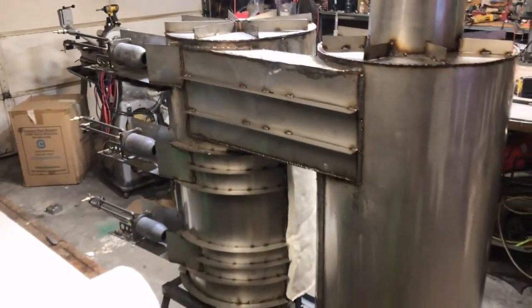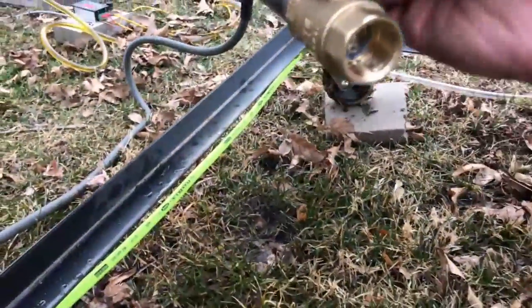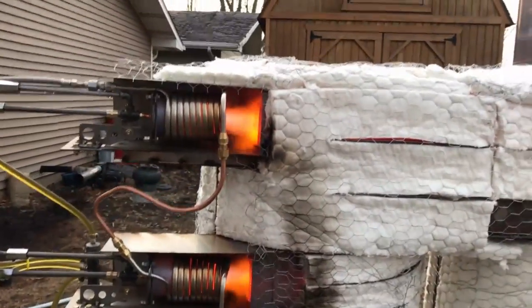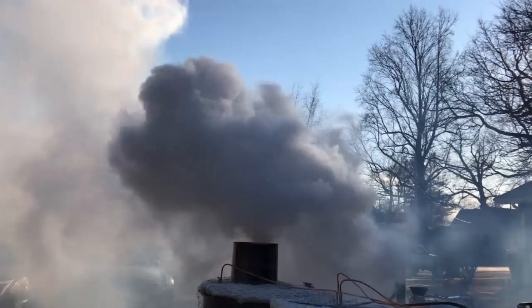This is designed around the principle of increasing residence time. I don't want the spray and the fire to just blast right out of this thing instantly. So I decided to go with a dual cyclone setup so that the spray mist is trapped inside the device and the ash and entrained particles will have plenty of time to burn away.